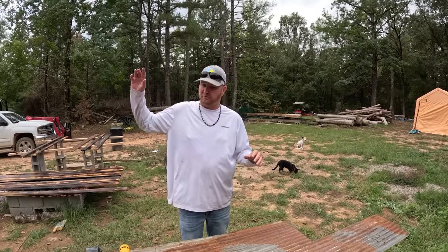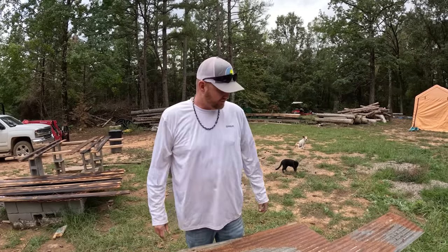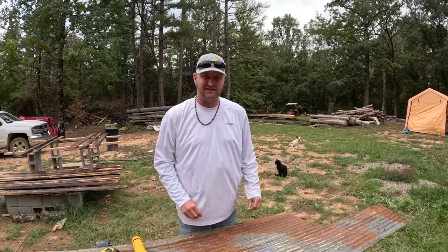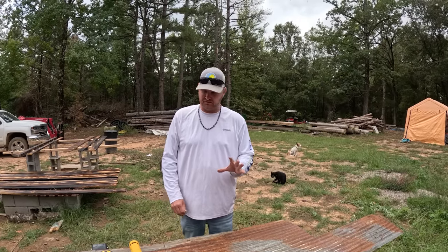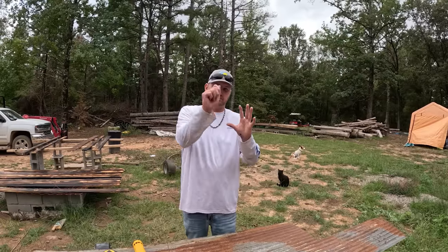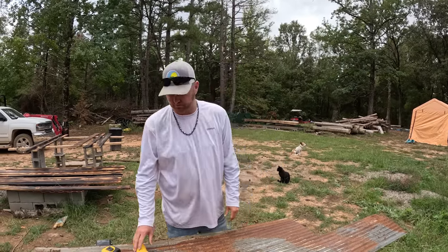Alright guys, this is already laid out. I just got through doing it for the end caps for the cabinet. We do got some holes and stuff right here, which I think is going to show up with the particle board back there, but probably what we'll do is take that paintbrush with some paint, stick it up there, kind of see where it's at, and just paint black behind it, so whenever we put it up against there, it won't show.